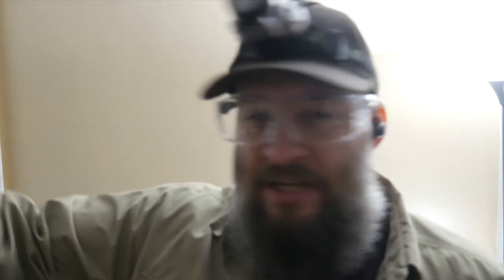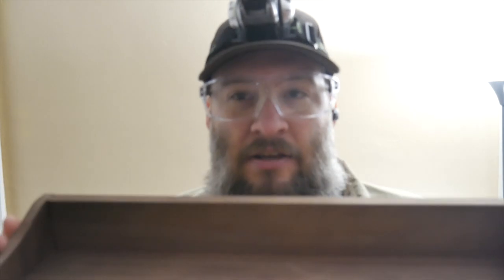The key to hanging stuff on the wall — of course, you can just pound a nail into the wall and hang a little picture up. That's fine; drywall will hold up a little itty-bitty picture, no problem. But when you've got something like this rack here with a shelf, something that's going to hold a lot of weight or even a moderate amount of weight, you're going to want to put your nails or screws into a wall stud.